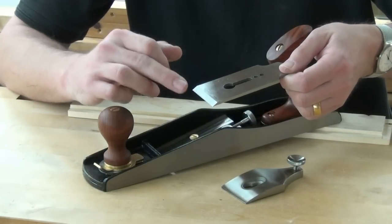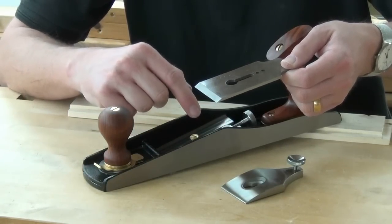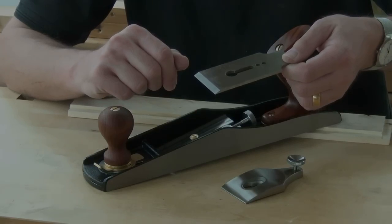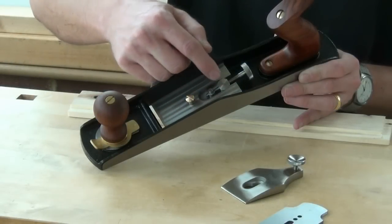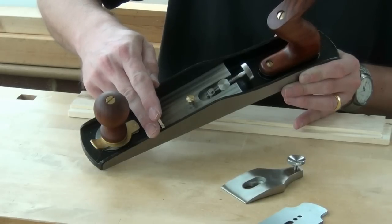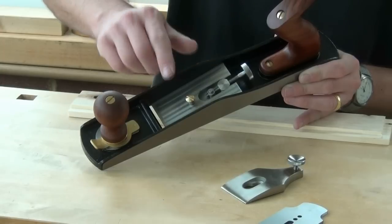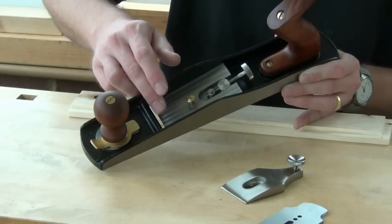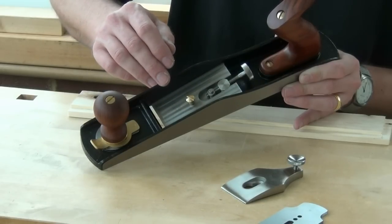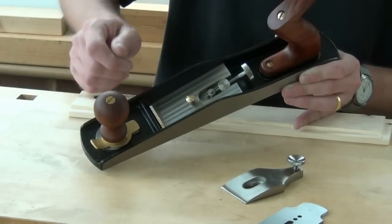It's putting the plane bevel up, so the effective planing angle is the bed angle of 12 and a half degrees plus whatever angle you decide to bevel the front of the blade. The bed that the iron rests on has been milled, and as opposed to the bench planes, getting a milling bit down to that bed is a lot easier — these wings are much lower and we're only trying to create one flat surface, not a pair of mating surfaces for a frog. So I'm hopeful that it's quite flat.